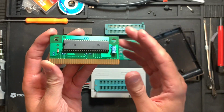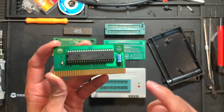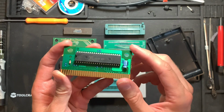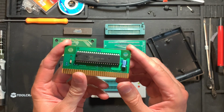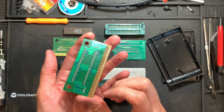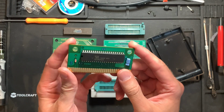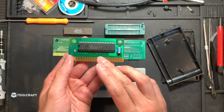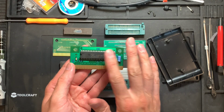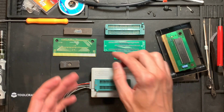And you can't reprogram that. This is fixed as it is. There are two capacitors, one larger one and one smaller one, for buffering power basically to the chip, I guess. It probably won't run perfectly well without that. So what we need is a replacement PCB, a replacement ROM, and some small parts. That is pretty easy to do.